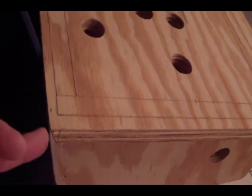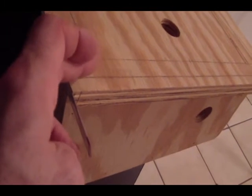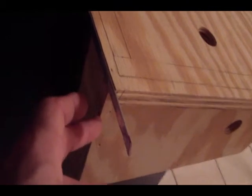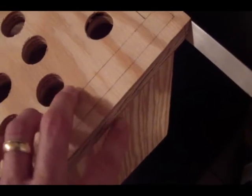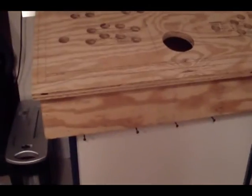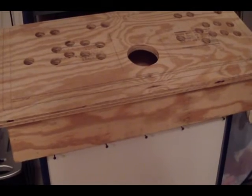and it's only a 16th of an inch thick, but I went ahead and stuck it on there so that when I mocked it up, I can make sure that it's all the way flush, this part, and not the actual wood with the back of the control panel box, because this has to come down and meet exactly with this so that when it's mounted up tight against the side of the cabinet, everything's flush. So it's kind of sitting in there mocked up so that everything can be in position, and all of our spacing, I've got it all marked out so everything's spaced off correctly, and got the equal amount of overhang, a half inch on each side, front to back on each side, so the overhang is equal. And right now I'm just going to go ahead and use some pencils and mark up the locations of the hinge on the front, and go ahead and put some tape on it so I can remove the panel and pre-drill the screw holes for the top panel.